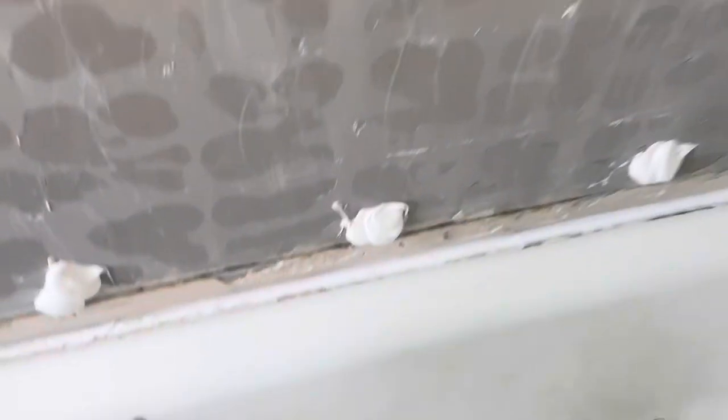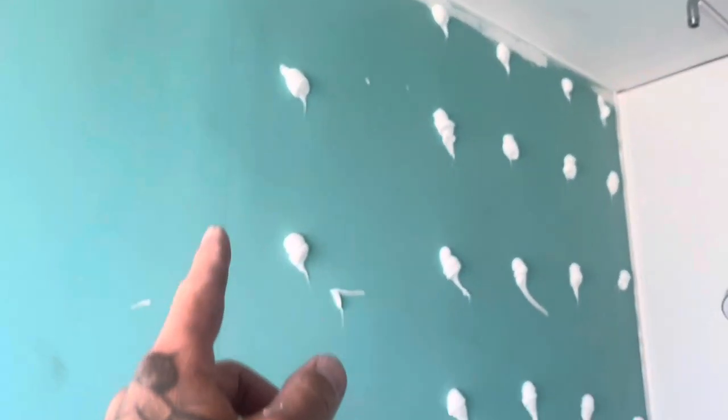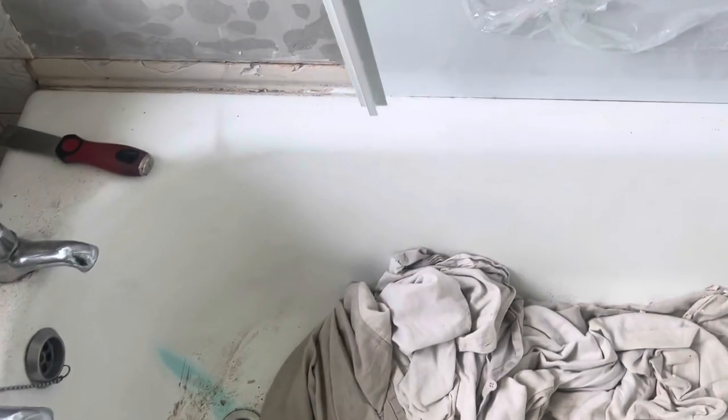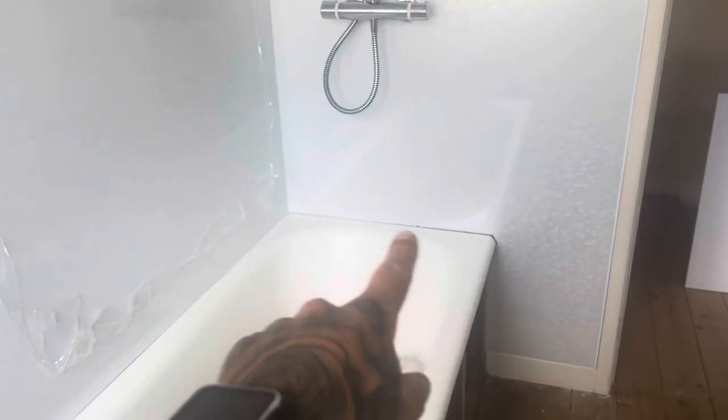Always make sure you've got a bead down behind the back of this. This is what I mean about the chamfered edge - can't see it on the picture really. Get that stuck back now and a jointing piece here in line with this crack. You've got silicone on the trim there - this is a joint in the trim. Caulking around the top now, sealing around the bottom. I'm going to put a shower curtain with an angle around instead of a bath screen - it probably wouldn't have sealed very well on top of that anyway. That's me out of here, thanks for watching, don't forget to like, share and subscribe.